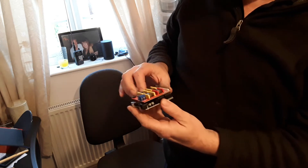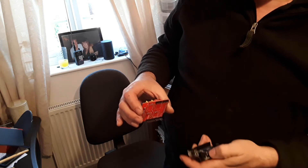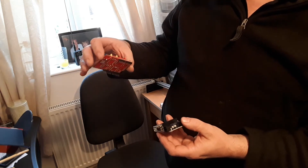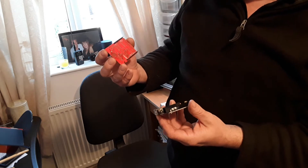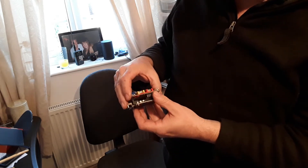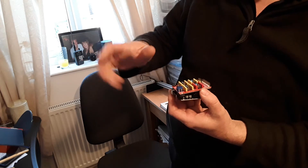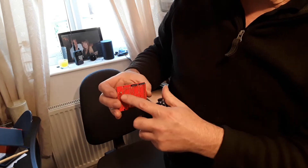To transfer the power round onto the top CNC shield you need to solder on this positive jumper wire. It just makes it easy so you can pull the two boards apart to work on them, to adjust or do whatever, and you don't have to disconnect your wires. Otherwise you'd have to bring a jumper from the bottom board up to these two connector terminals here, which means unscrewing it — a bit of a pain.